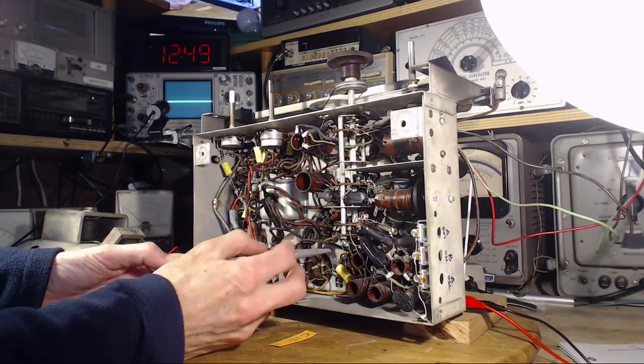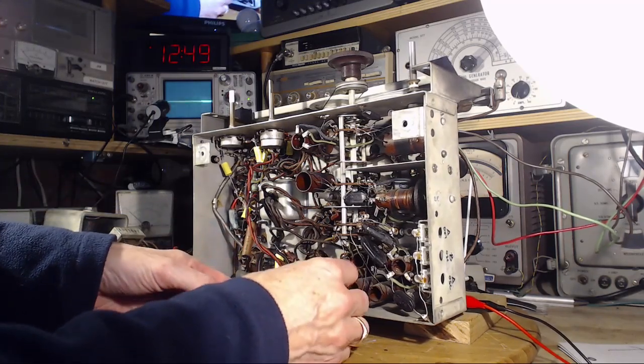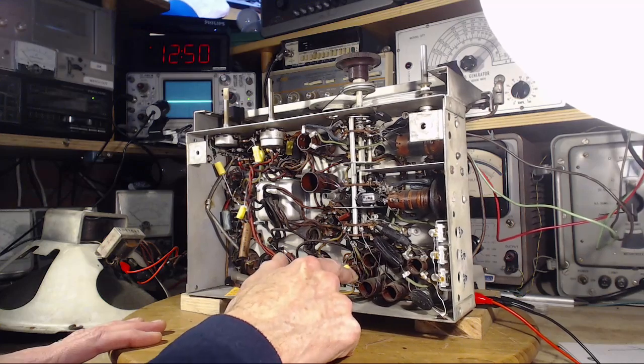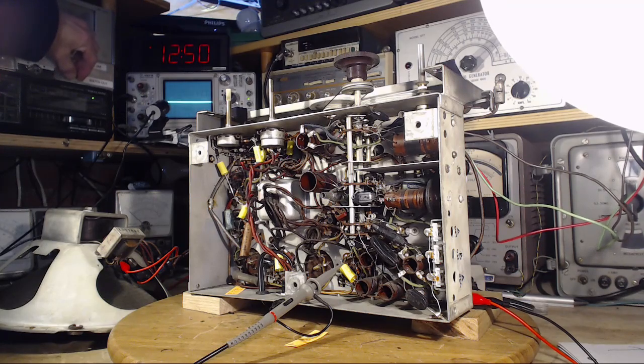Okay, on to the high end of the capacitor. Scoping. Make sure. Okay, good. We're ready. Dim lights on. Scope coming to life over there. So it's gone off the screen because there's a DC voltage developing in the radio. Just like I said, there's that signal. It's not quite as big as it was, but it's still there.